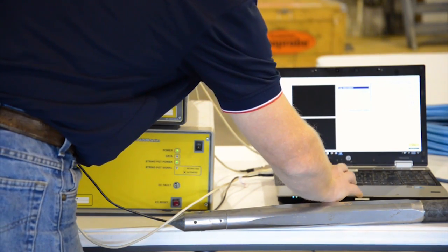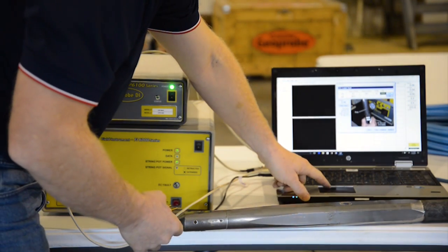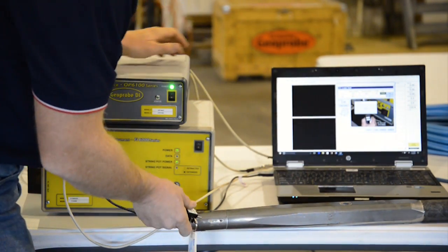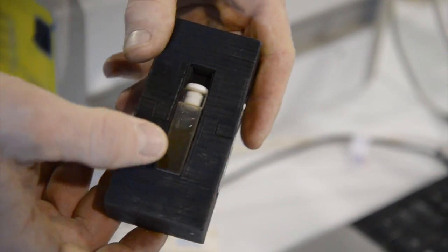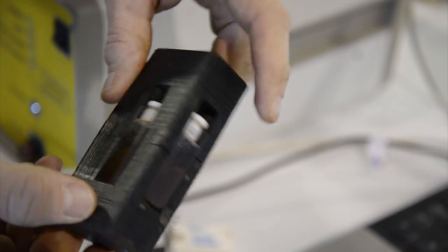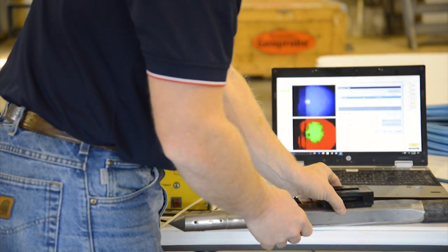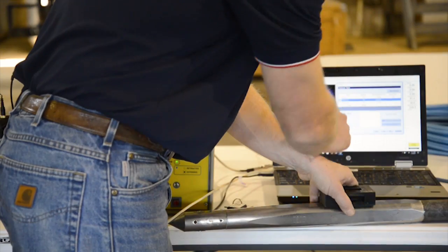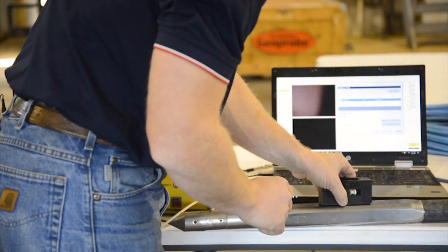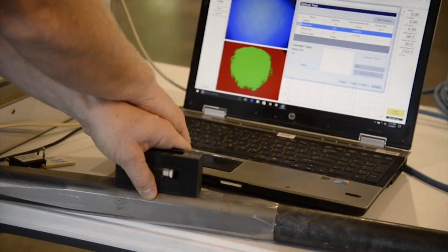Before beginning the actual logging, there are preliminary QA tests to run. First, record a high and low test load of the electrical conductivity using a dipole tester. Next, you'll need the black test box containing diesel fuel and motor oil. First, hold the diesel fuel side to the sapphire window on the probe and capture its fluorescence. This will help you make sure you are seeing correct imaging. Do the same type of test and capture of the fluorescence seen from the motor oil.